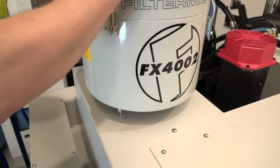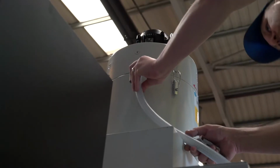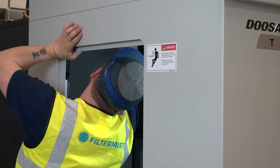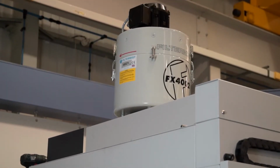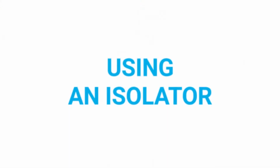Position the unit and secure to the machine tool. Position the oil return tube to drain oil back to the machine enclosure, sump or collection vessel. There must be no kinks or U-bends in the return tube. The end of the tube must not be submerged.